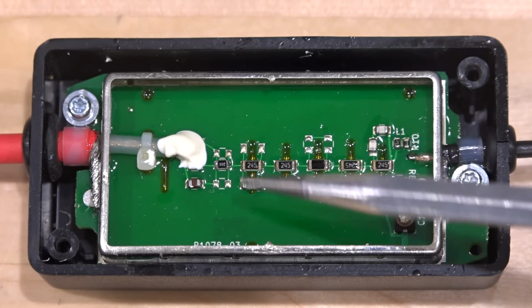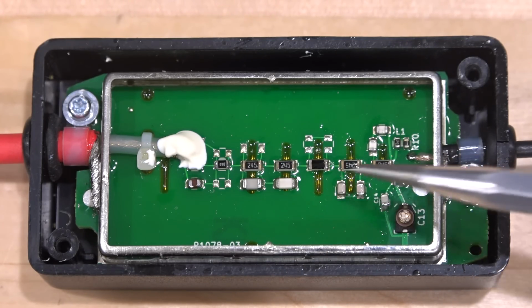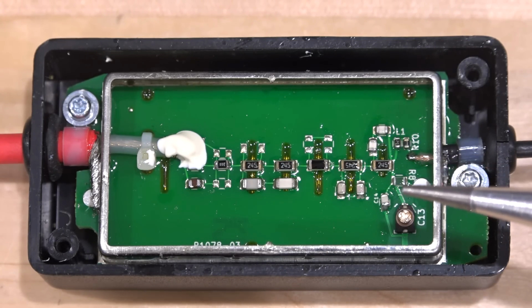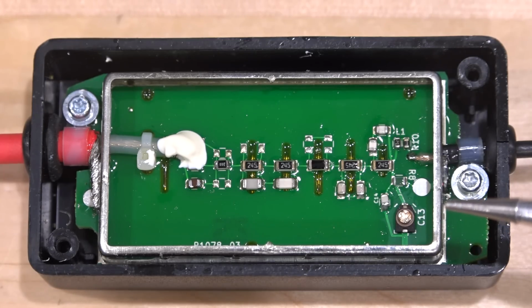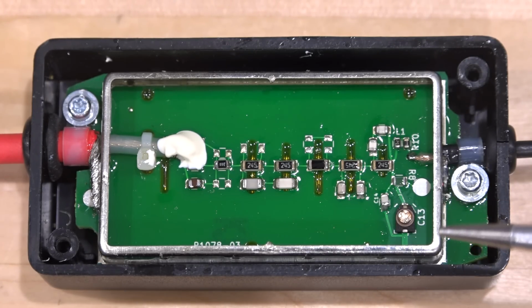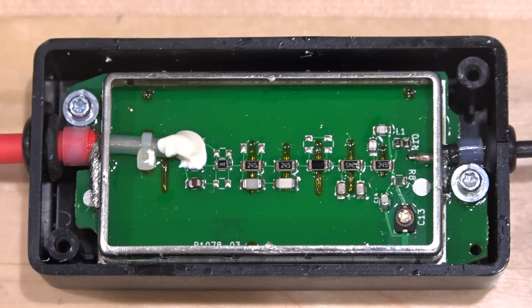The slits in the PCB are filled with epoxy, which probably doesn't make much of a difference, but you do have the division across multiple resistors over there to slowly bring the voltage down and prevent arcing and so on. There's also capacitors in there, and this entire thing has to be very, very carefully designed. It's not easy to divide something from 2000 volts down when you do have to maintain a high frequency response through it. It's all custom made, of course, by the team.